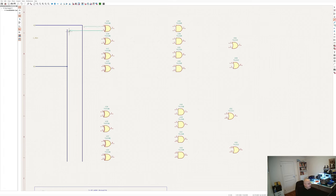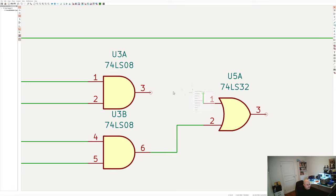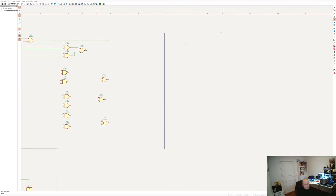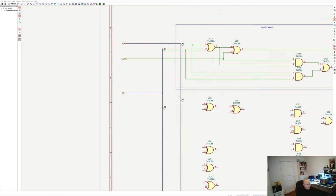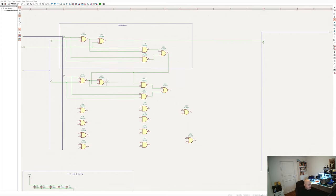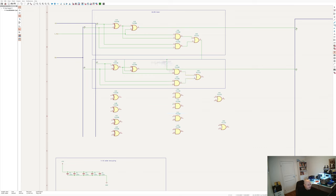For the 8-bit adder, it will be exactly the same as my 8-bit adder in the logical design, but now it will be built not from eight 1-bit adders but from two 4-bit adders. The only difference is I need to accept an 8-bit bus of operands and split it into two 4-bit buses connected to my 4-bit adders, with carry out and carry in daisy-chained. The carry out of the last 4-bit adder is unused, and the result is combined and sent to the external port.